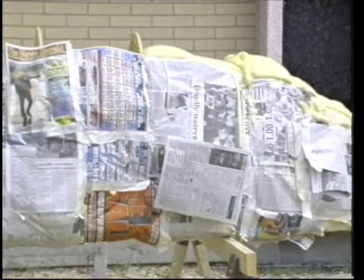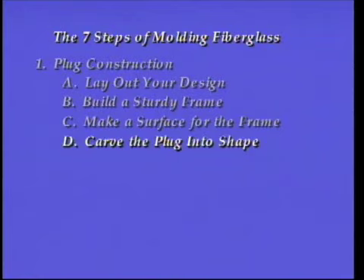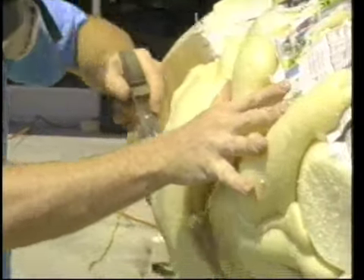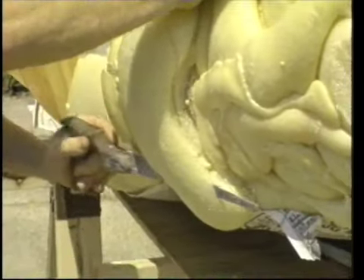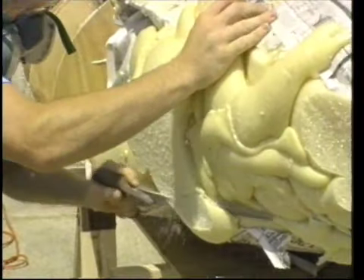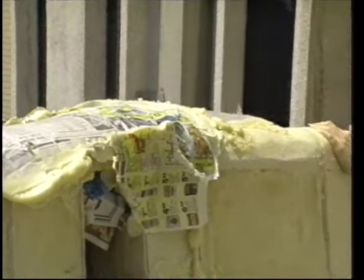The newspaper on the outside will simply be shaved off with the excess foam. Now you will begin the fourth step of building your plug, which is carving it to the correct shape. Saws and knives easily cut the foam, but it cannot be hotwired. You want to trim away the excess and sand the surface smooth. Remember that the plywood bulkheads provide the actual finished dimensions, so do not gouge the foam deeper than the plywood.